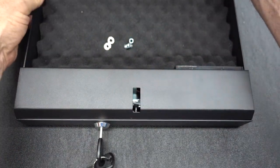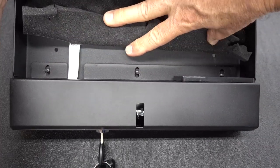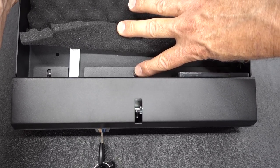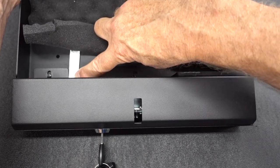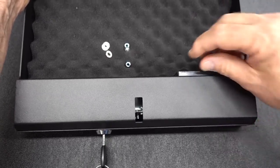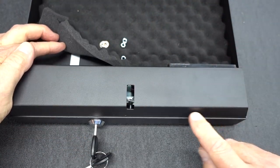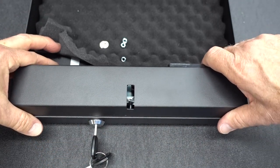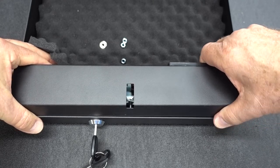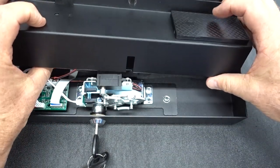The locking mechanism cover is actually held down to the bottom with three screws — I've already taken the nuts and washers off — one, two, three. Those screws are actually welded to the bottom of the case, so drilling them out from the bottom is not going to do you a bit of good. There's the ribbon cable that comes from the electronic package all the way around the perimeter up to the keypad on the top. Notice even when I take the bolts out it's very solidly attached — there are three points in the front with T-nuts that hold this on, and you have to pull it straight up. If the cover were in the locked position, this would be physically impossible.